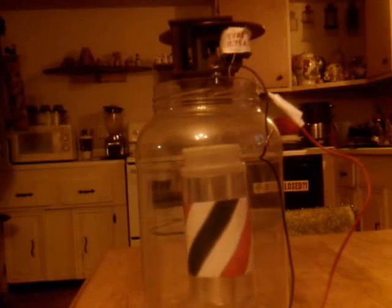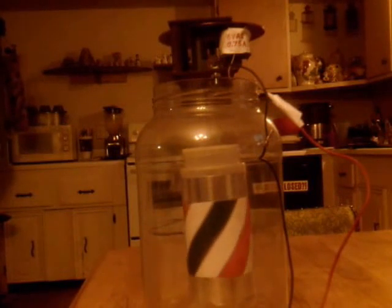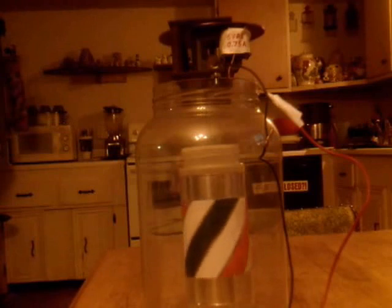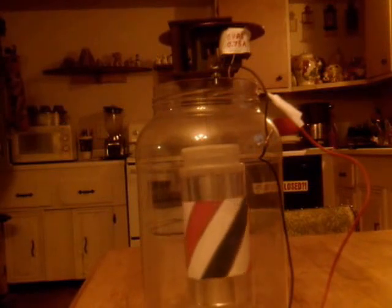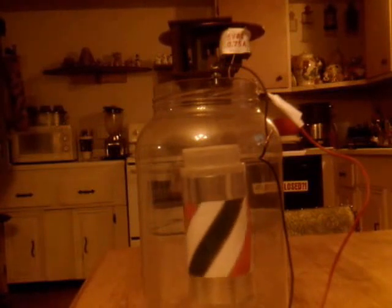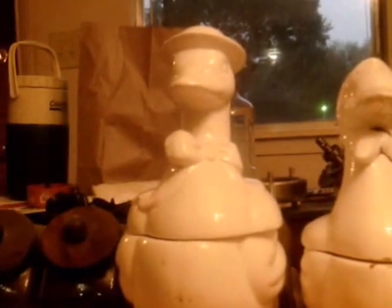Alright. Yeah, probably going to stop on me. Well, it's not turning real great, but there's very little torque on this motor the way I made it, because it's only running off of 6 volts, and it's a little bit less than 4 watts. I forget why, but that axle's not a real good fit to the raceway in there. It's a little bit loose and it can get stuck sometimes.